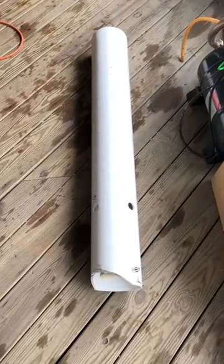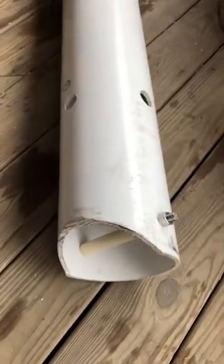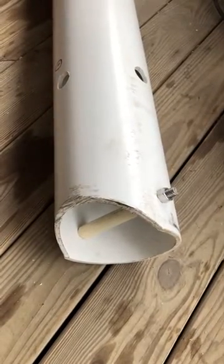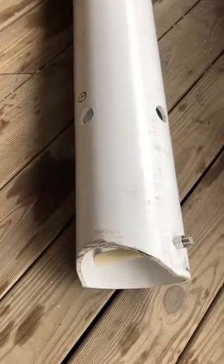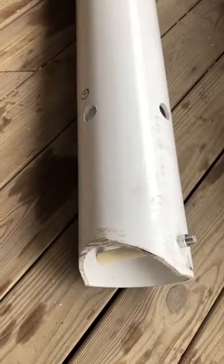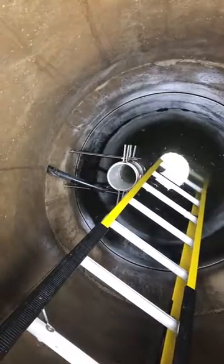Here's my new standpipe — four feet long. I cut a chamfer on the bottom edge. I've got a threaded rod to hold the motor up off the bottom, and I've got a PVC piece of pipe over the rod so there's no metal-to-metal contact when the motor runs and vibrates. You can see my mark — that's the water line on the pump — and I drilled the holes just a little bit lower than that to keep the water line at a maximum and up out of the mud. There are four of those holes to let the water in to make up water for the pump.